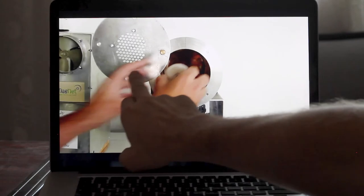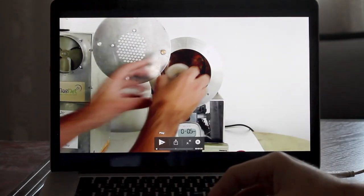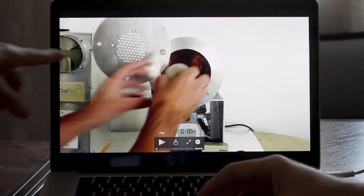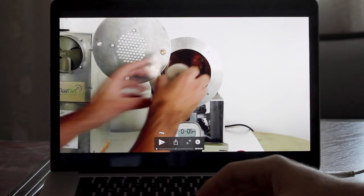So this port that you've developed here to observe, the reason for cutting these holes at this size is because? To look through, and it is open actually, but the thickness of the lid is important. This is 6 millimeters, and the diameter of these ports is also 6 millimeters, but at L per D 1 to 1, it allows you to contain the microwave radiation, otherwise it would escape. So the design of the number and the depth of these holes are also important, and we were helped by an elderly gentleman who spent all his life in microwave devices. His help was absolutely essential, apart from textbooks, of course.